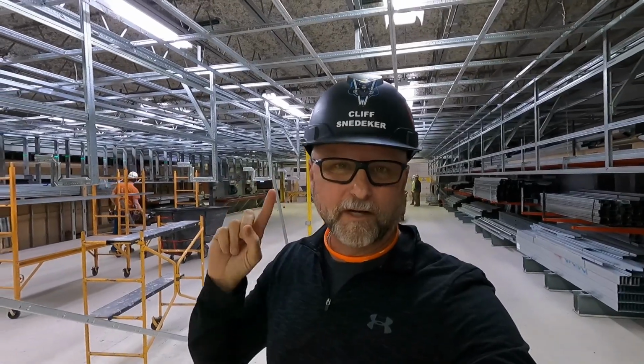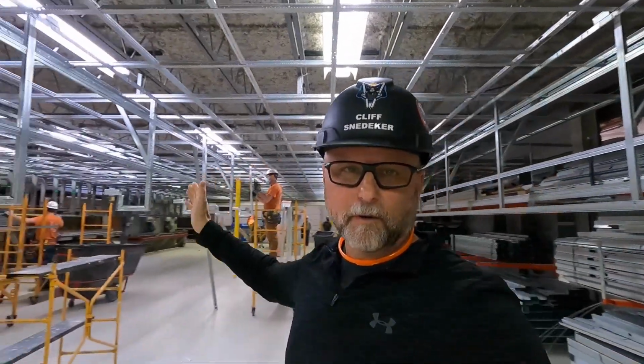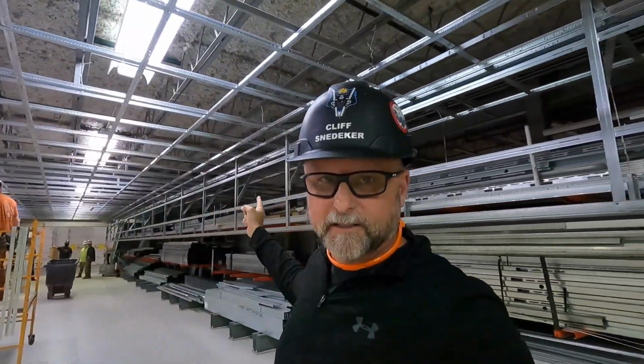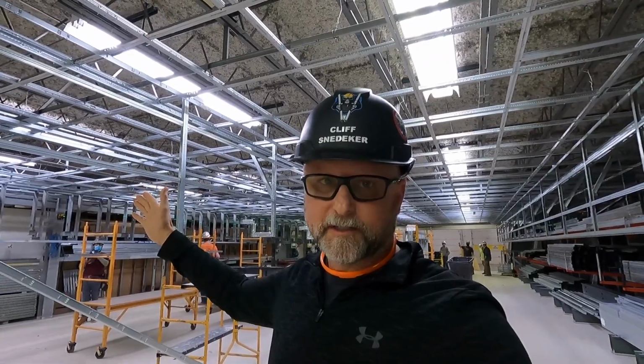Okay, I'm between 2 runs here. On this side, we have conventional drywall grid with DW90 clips, and on this side, we have simple soffit. Now, on the simple soffit side, we got 80 running feet installed in 3 hours and 45 minutes. Over here, we're about half that, about 40 feet in the same amount of time, and that's the difference between jigging. We eliminate the jig on the simple soffit side, but we still have to jig up the template frames for the soffit drops on the drywall grid side.